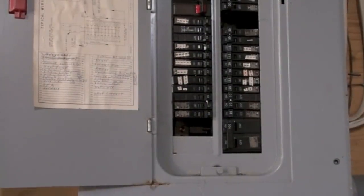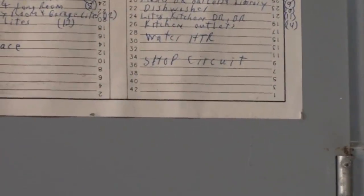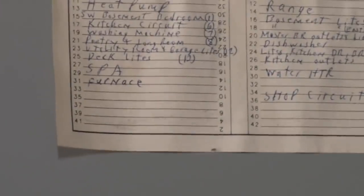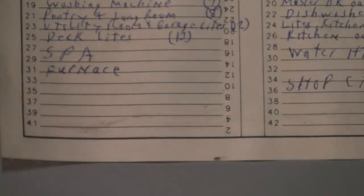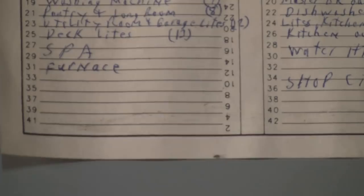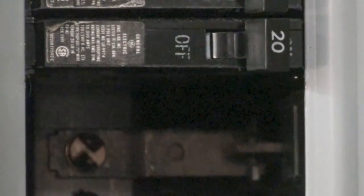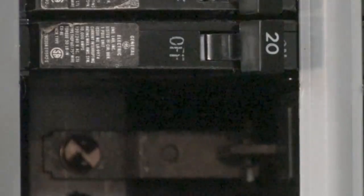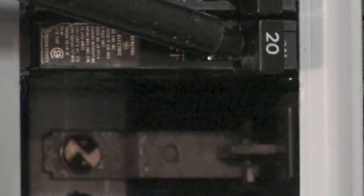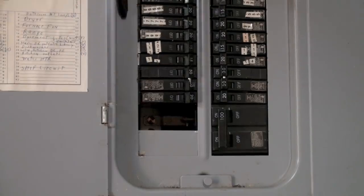Come to my breaker panel. I'm gonna look on the little sheet on the side, which we hope is accurate — may or may not be, some of these aren't so good. I notice, lo and behold, I do have one that says furnace on it. If it's here, the numbers don't always line up on these things, and some of them the numbers aren't even there. So I'm gonna go down — it's the last one. I'm gonna go over to the panel and look for the last one on the left side. I found the breaker, last one on the left side. It could be marked on the side here too — sometimes they do that.